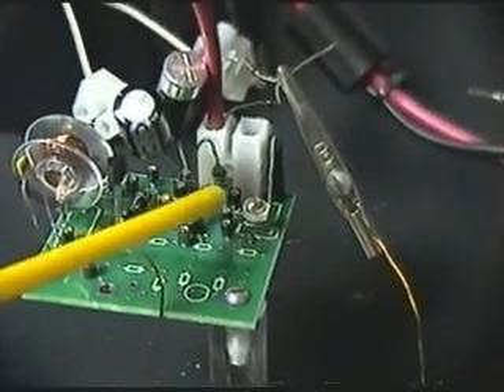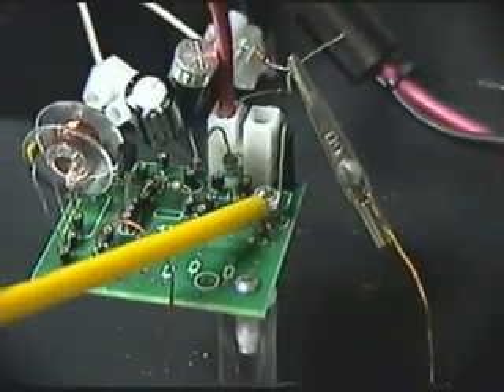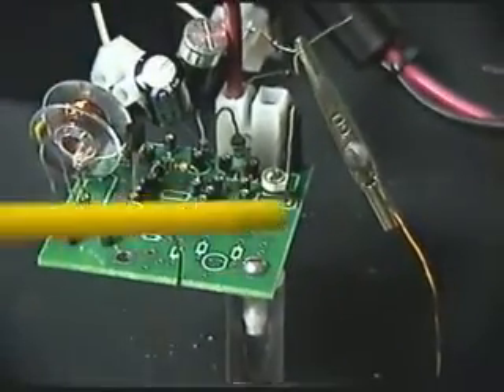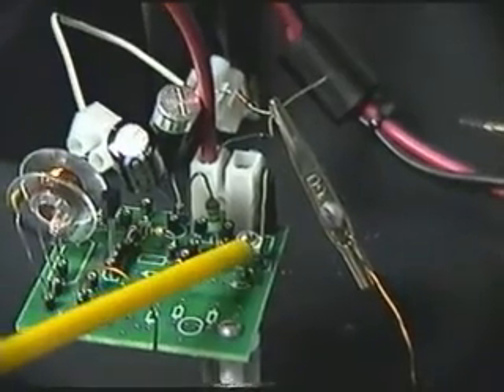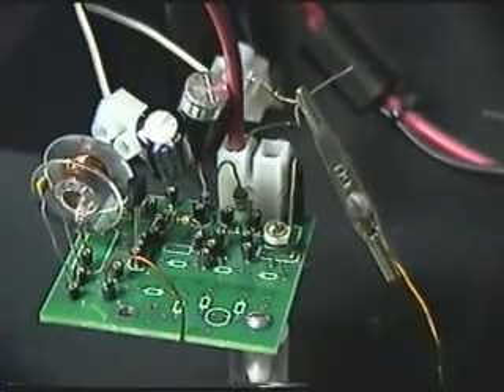The reason for that is that when C1 is up here, the impedance is higher, and it's more sensitive to your tuning when you attempt to tune it. By moving it down here on the other side and having L1 in between C1 and the base of the transistor, you reduce the impedance and the effect of external or parasitic capacity from your tuning to your body when you tune it.